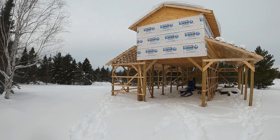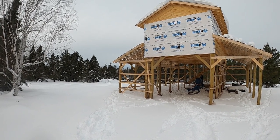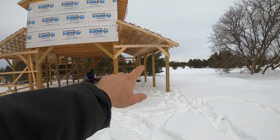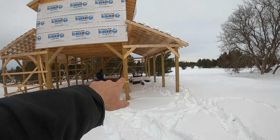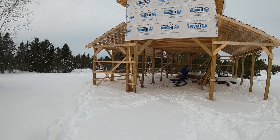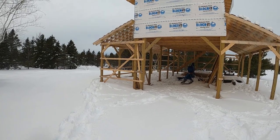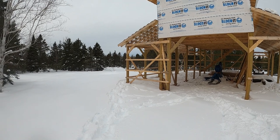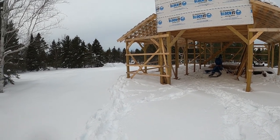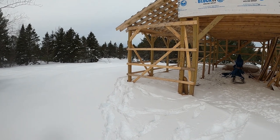I'm milling my own lumber for siding so it's not a huge deal, but if you're using like the pro-rib siding that Menards sells it would be kind of an issue. Along the whole bottom of the building, we're going to buy two-foot sections of black pro-rib metal from Menards to go along the base — just so the wood isn't so close to the ground for moisture reasons. But now that my building is bigger than 30 feet I'm probably going to have to cut and slice some pieces, and it's just not ideal.